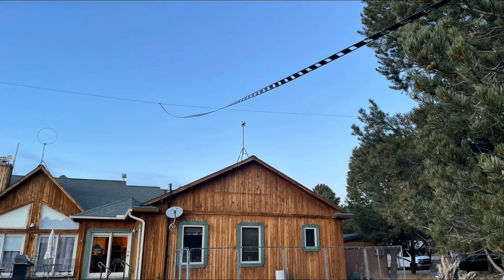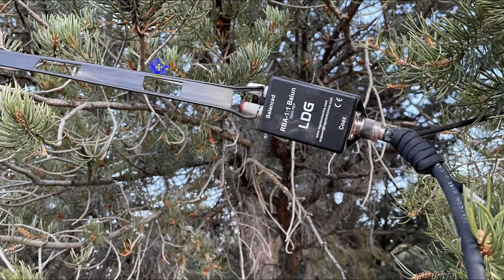Here's what the antenna looks like after we put it up yesterday evening. The thing is about 100 feet long, and it's got 39.1 feet of ladder line, which was measured very carefully. It's only up about 30 feet, so if you drop the ladder line straight down, it's going to end up on the ground. We pulled it over to a tree — you can see some parachute cord going over and tying to a tree limb. It's up high enough that nobody will trip on it.